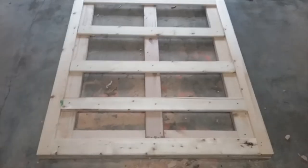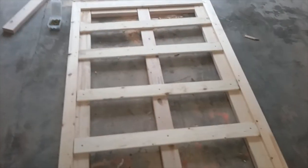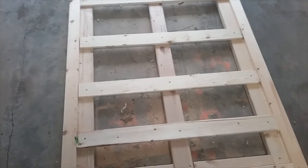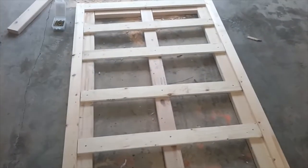I just put one screw in each end, and one in the middle, nine of these things. And that may be a little overkill for a twin bed, but these boards will flex more than what you can take, so if it fits, nine slats, like I said, plenty sturdy with the nine. Now, who cares? The mattress is going to set on top. So, basic platform bed.